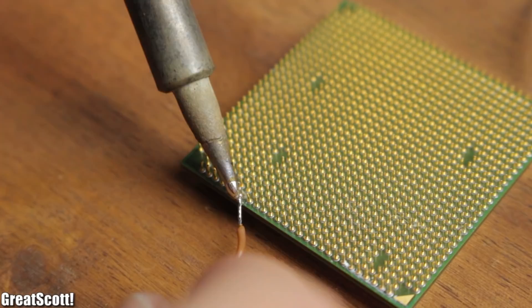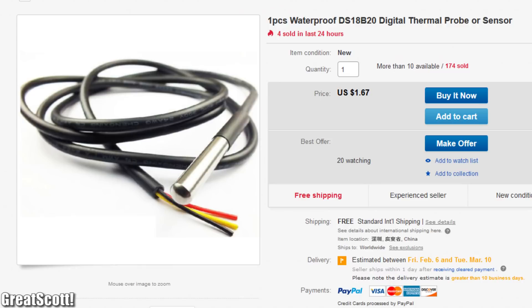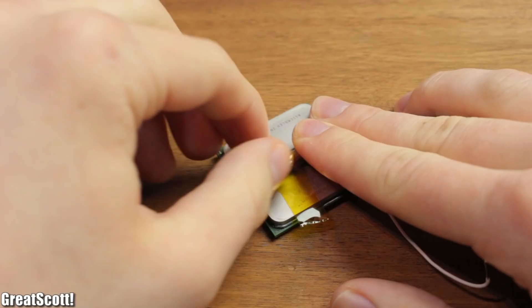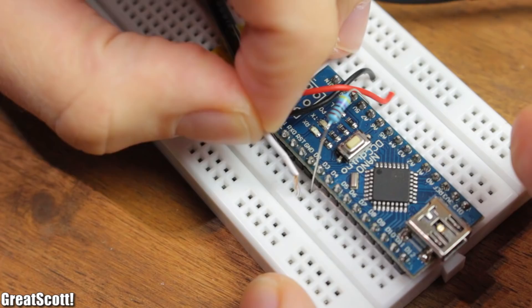Finally I found a matching pair with a current draw of above 400 milliamps. I marked both pins and soldered a wire to each one, then hooked them up again just to make sure it still works. I used a thermal probe consisting of a DS18B20 temperature sensor to measure the temperature rise of the heated surface, and with Kapton tape I secured it snugly to the surface. I also connected the data wire with a pull-up resistor to an Arduino Nano to receive the temperature data.